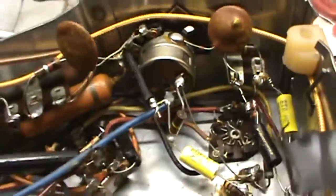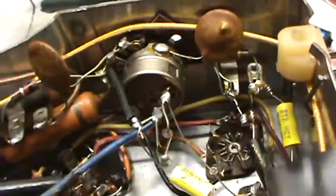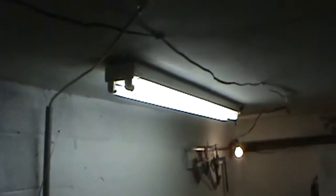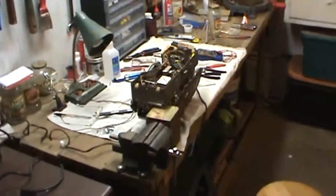Been busy the past few days — yesterday afternoon I put new mulch around the flower beds in the front yard. You'll notice there's a little bit more light in here now. I took out this old light fixture; I think the ballast has gone bad on it. I put two new bulbs in at some point and I'll try it to see if the ballast is bad or if the old bulbs were bad. I put up a brand new light fixture over here and it's putting out a whole lot more light — I can see what I'm doing now, which has sped things up considerably.